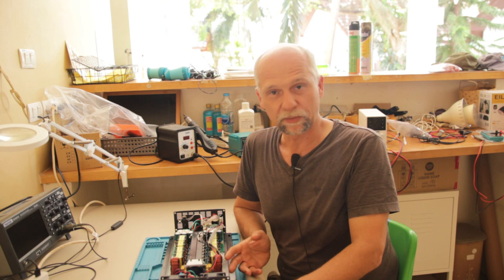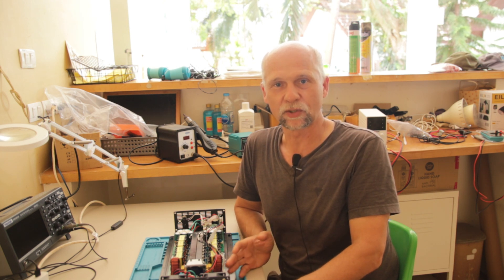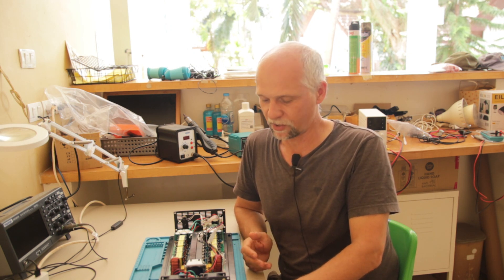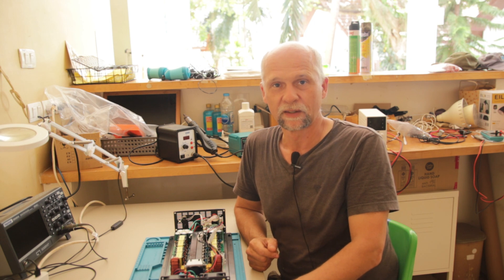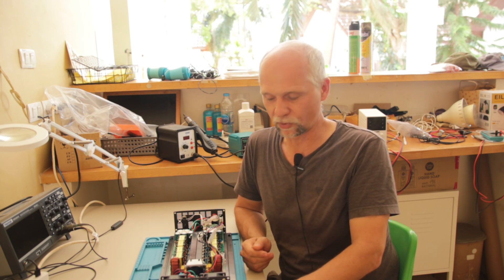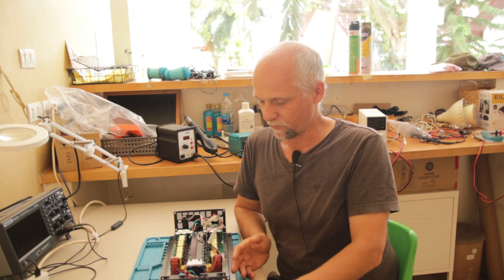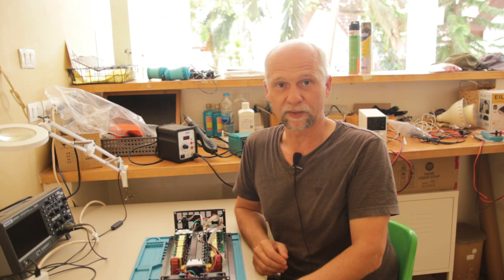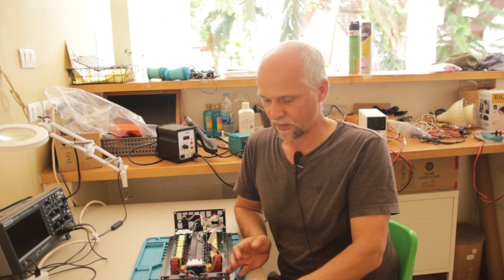In the meantime I received a diagnostic manual for these inverters. I took that manual, checked what was checkable, and found out that the damage went much deeper than anticipated. The internal power supply was damaged and also some power components in the control circuitry. Because of that the microcontroller was exposed to 12 volts instead of 3.2 volts, so that one blew up too. By going through the diagnostics manual I found about 10 items which were not correct.